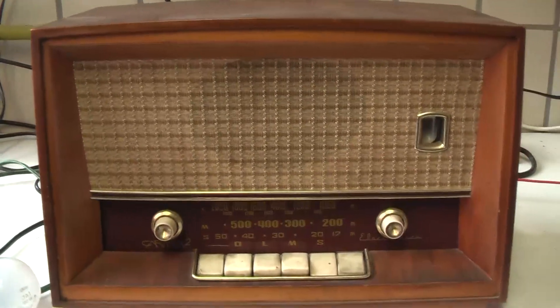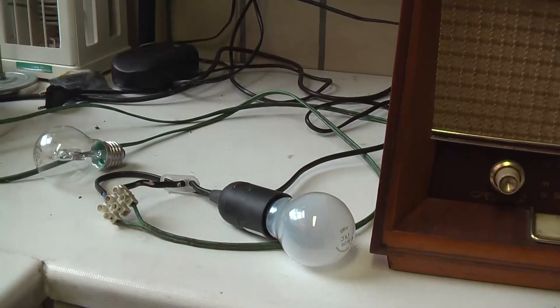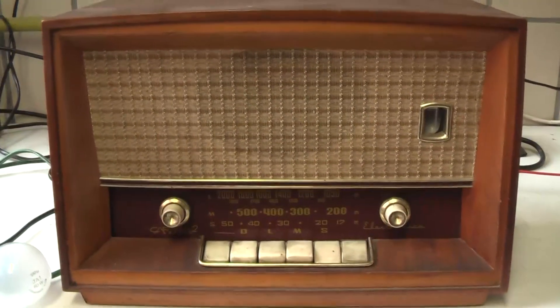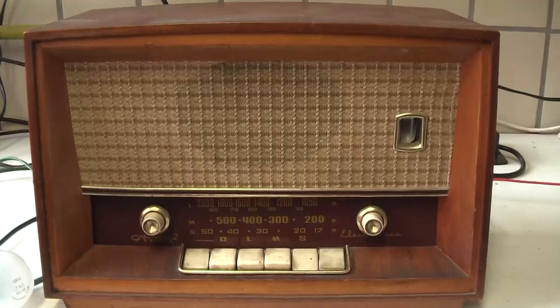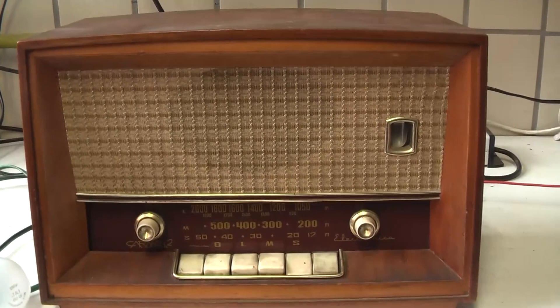So I had just rigged it up. I wasn't in my normal workshop, so I didn't have an isolation transformer. I just rigged it up to a current limiter bulb, ran it up firstly with the 25 watt and then with the 40 watt — nothing particularly spectacular in any way. It seemed to work.